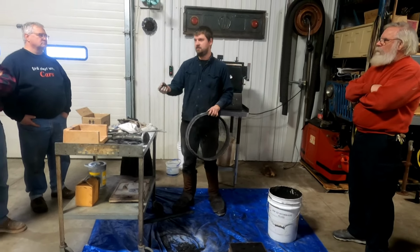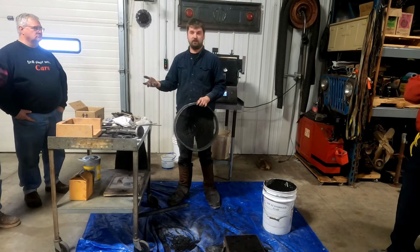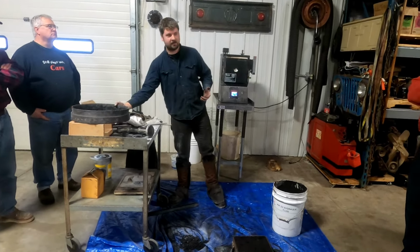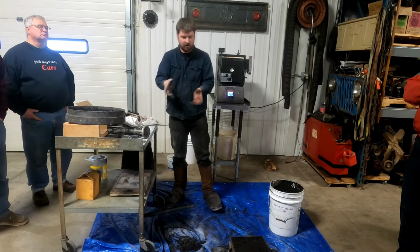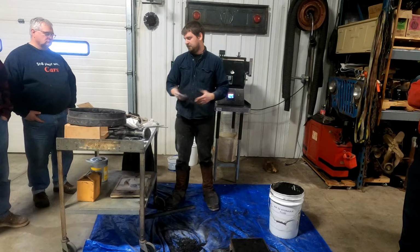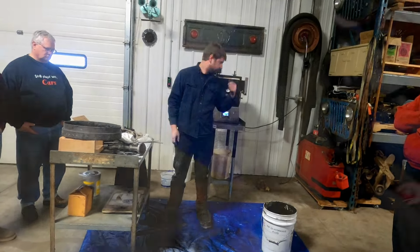It's water glass. It's a two-part binder. It mixes together when it hits heat and fires, and it's stable up to about 2,500 degrees Fahrenheit. So you'll mix up the sand and the glue, you'll pack the form, you'll let it stay until it hardens, you remove the form, and now I've got a sand log that I would have put in that mold before I closed it. So maybe if we do another demo at some point, I'll bring a core pattern and show everyone how the form works. But that's it for now.